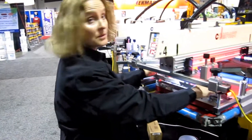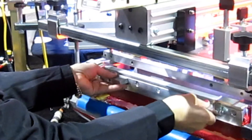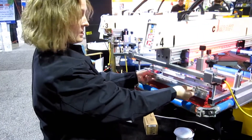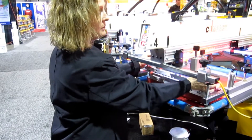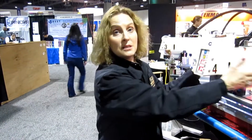Now I'm going to show you how to take the squeegee out. We have new squeegees. To release the squeegees, you turn the handles. Grab hold of these two handles here and you simply slide it out like that. So you can see it's much easier. You just literally put it straight in like that and tighten it up. With our new squeegees, they actually pivot from the center. So when you used to angle the squeegee, you'd angle it like that and you'd have to put more pressure on. But now our new ones pivot from the center, so you don't lose any pressure — you don't have to add or take any pressure off the squeegees.